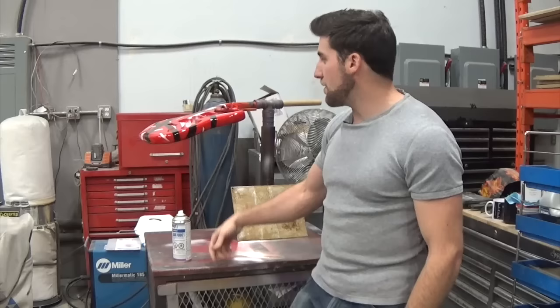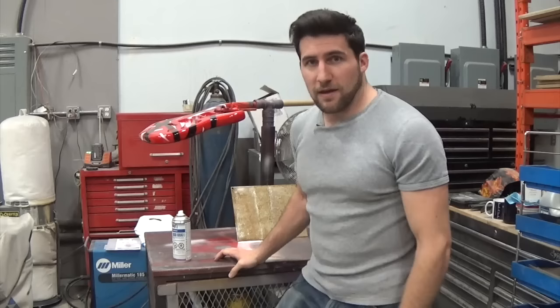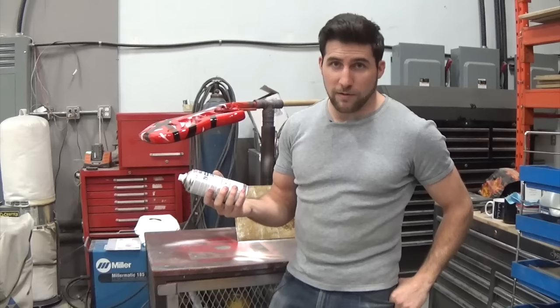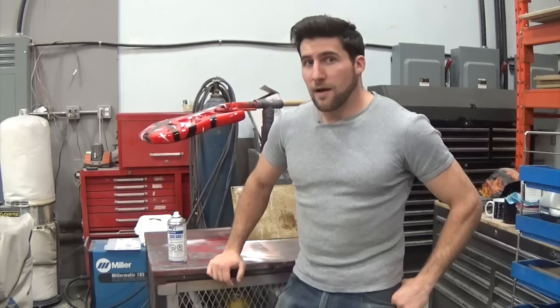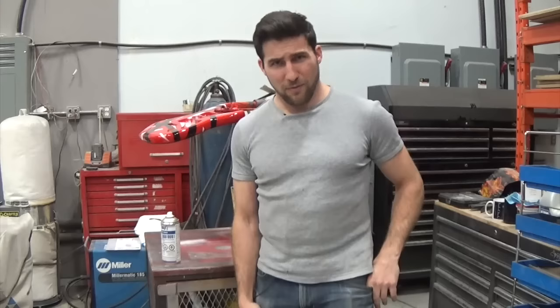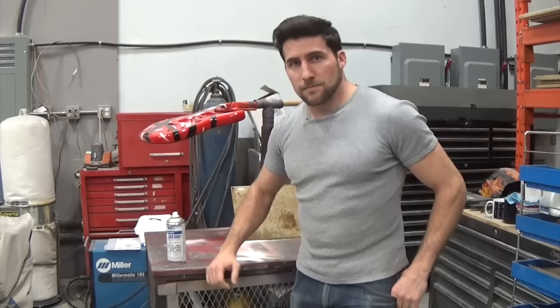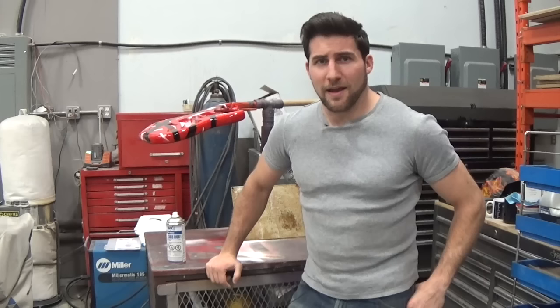So if I went in and added those steps — sanded this nice and flat up to a high grit and polished it as per any one of the polishing tutorials that I've done — you would see it would look exactly like a professional quality finish; you wouldn't be able to tell the difference. So I hope you found this video helpful. If you're looking to get a nice high quality clear coat on something using spray cans, this is the method I would use. I'd pick up some catalyzed polyurethane — there are a couple of companies that make it; this one is Spraymax. Make sure you're using the proper safety equipment and make sure you're prepared to spray when you activate the can. It's catalyzed so it dries quickly — make sure you give it at least 24 hours, I'd give it probably 48, and then you'd be ready to sand and polish it.